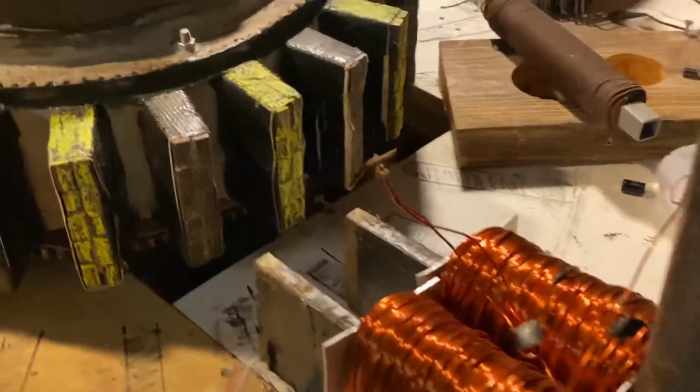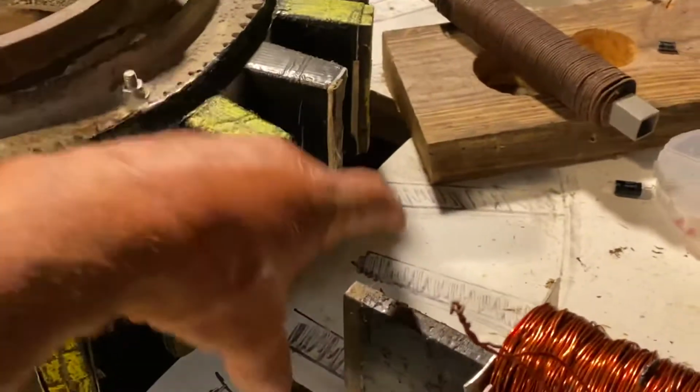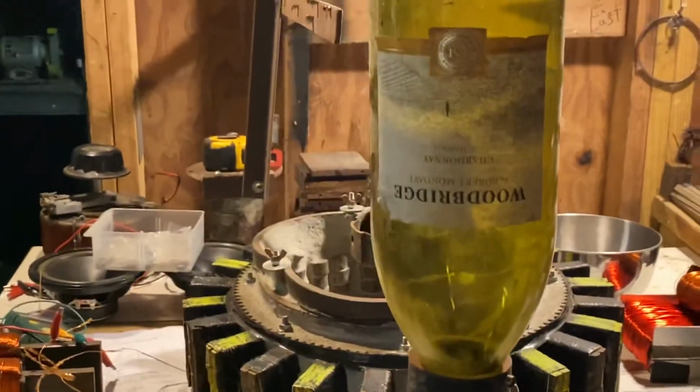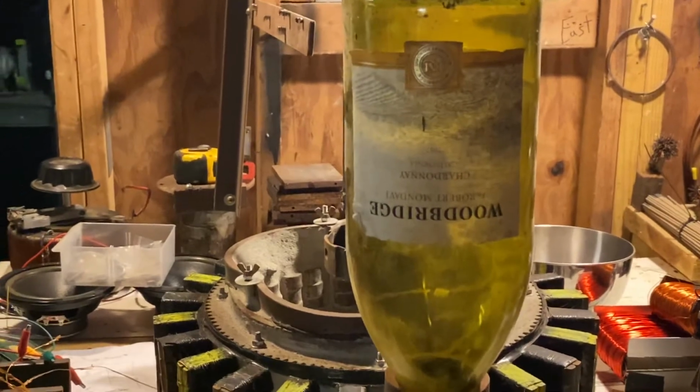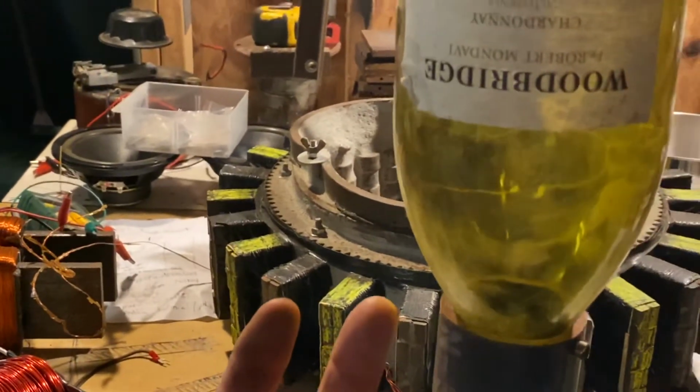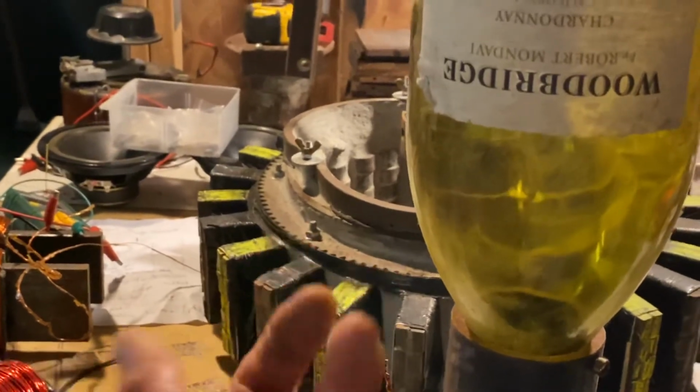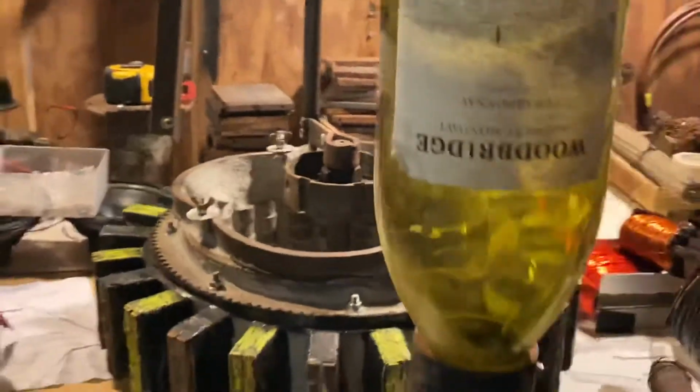With that being said, when this pole is hitting this pole, these two are going to be connected to the two condensers up top. The condensers are going to be treated like a Wimshurst machine, where you have two capacitors and the two inside ends or outside ends are connected together. Doesn't really matter. And the two other ends are forced to separate the charge and create two opposite poles.